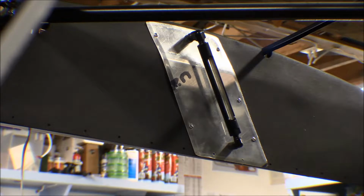There's that cover panel mounted up on the wing root, and the fuel gauge mounted up in there. That's the way it's going to go. Well, that one's all cut out, bent properly, fitted up, holes fit up nice. I drilled some holes in it and put some nut plates on the back side of that Kydex panel, so we can put number 4 screws in there, hold that thing down.